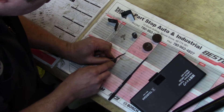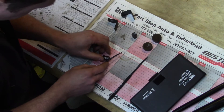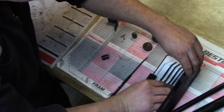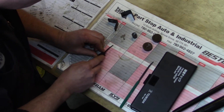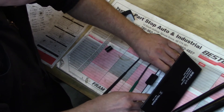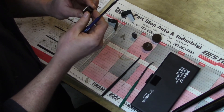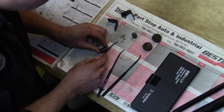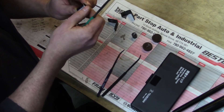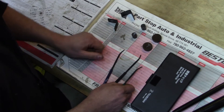Trying the corner of the tie rod end sample — the 45 just skates over the edge, and the 55 doesn't really want to take it off the edge either. The 65 is starting to bite in; the 60 will do it but doesn't like it. The 55 barely bites, and the 50 skates. So it's probably about a 55 Rockwell — that one can be heat treated.